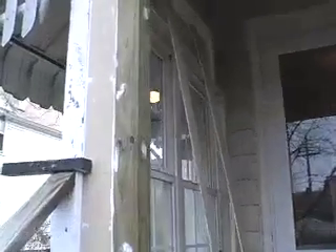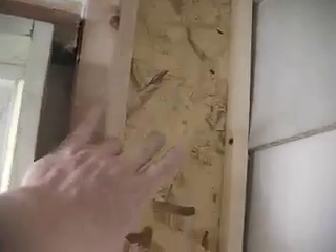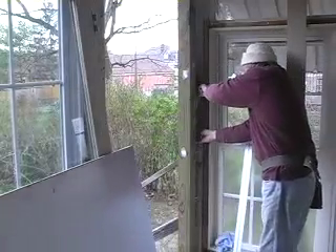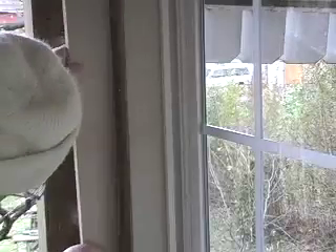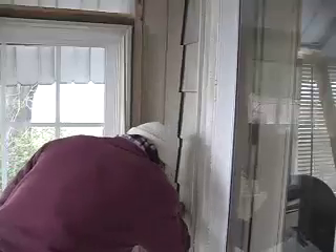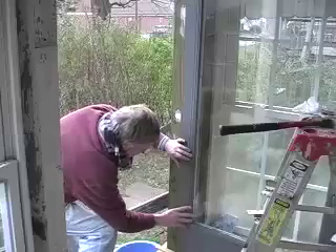Now we're going to do the door. Doors are always tricky. There's the 4x4 post I'm going to screw the door to and there's some sheathing I use to cover the outside. I'd love to put glass in that little six inch piece but I couldn't be bothered. So I'm going to throw some insulation in that space, and there's another space at the other end near the building itself. That's aluminum siding on there which is going to be really nice to heat up. Caulk these cracks — we don't want any air coming in. I'm using a Thermax polystyrene or polyurethane paneling with foil on it. Fill it up with that to insulate it, then put your cover piece on and use a drywall screw to hold it in place. Caulk the heck out of it — make sure there's no air. You don't want any air infiltration into your porch from the outside. That's really important.